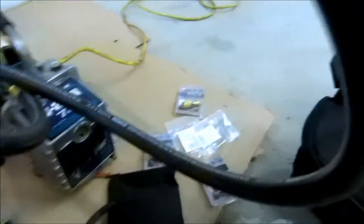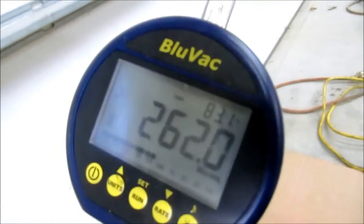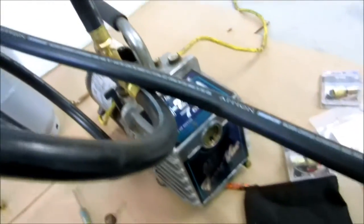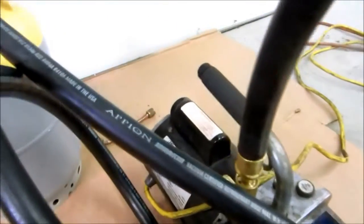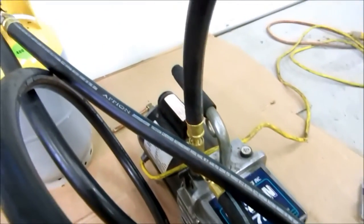I hope I didn't bore you with my stuff here today — I'm just kind of playing around with some of this stuff I got. It's always good to test your equipment and make sure that it's good to use out in the field. It's still pulling down. Probably should have changed the oil in this pump, but that's old oil in there — it's still pulling down. It's a good idea to change the oil every time you pull a vacuum. The vacuum pump I've got in my truck is a new JB — new style JB. I change the oil in that all the time.